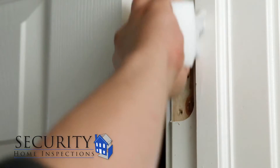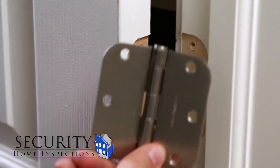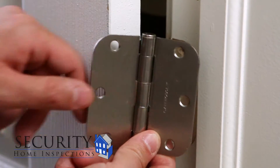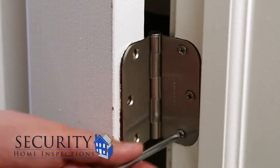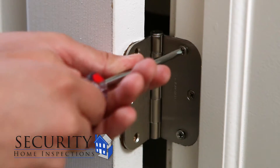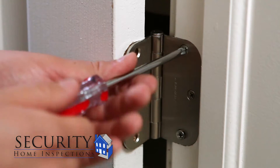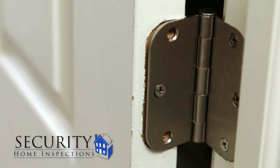This is a great time to clean if there is any dirt or dust clinging to the area. Next, install your new hinge. Make sure the top of the pin is facing up and that the hinge can fully close in your direction. Put the hinge in place and insert the screws connecting it to the door jamb, making sure to tighten all the screws. This will keep the hinge flush against the jamb. Now you can insert the screws to connect the hinge to the door.